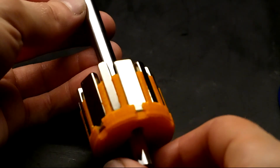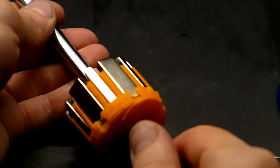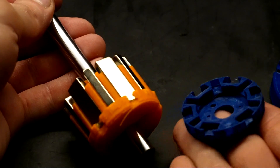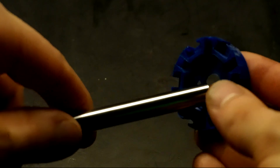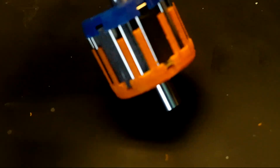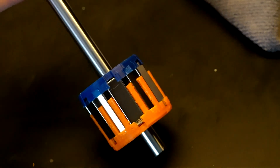The only real major downside to Halbach arrays is that they are an absolute pain to assemble. When putting the magnets into the slots on the rotor you're constantly wrestling with the magnetic fields of adjacent magnets, which complicates manufacturing. Having a Halbach array does mean you can omit ferrous materials from the design, which simplifies things quite a bit. I assembled the rotor in a very similar way to last time, except this time instead of two rotor halves I'm only using one, and for the other part I'm using a cap I designed by essentially cutting off most of the rotor half in FreeCAD and making some adjustments.